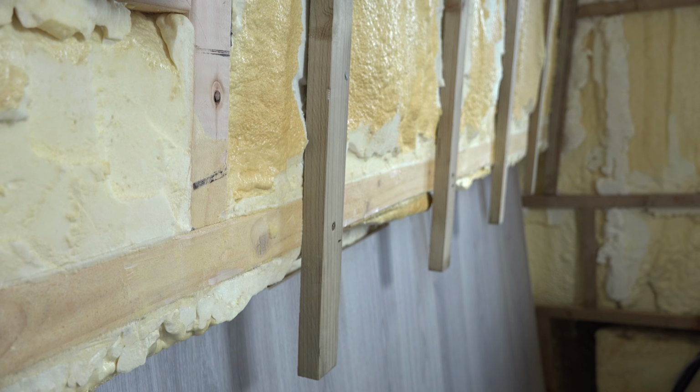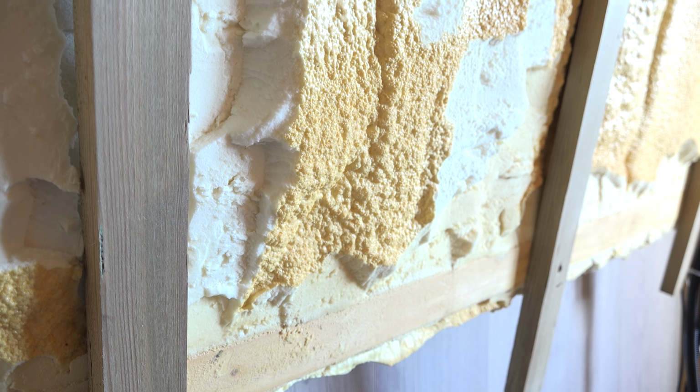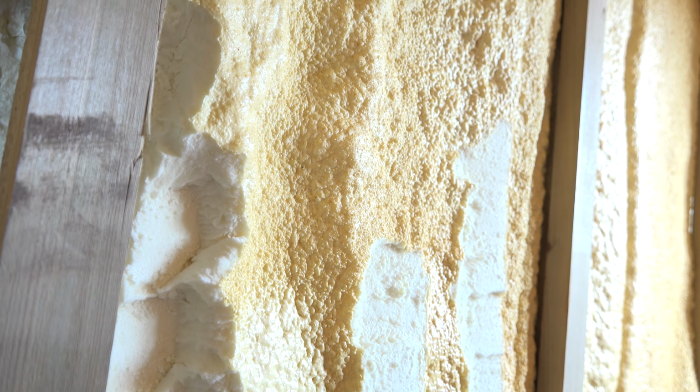The other thing I've actually been doing inside, shock horror, I have actually been doing some things inside. I've been starting to board it out. Now, as you know, I put vertical battens down above the gunnels, down the length of both sides of the boat. They were at 40 centimetre centres, and originally I was going to use some MDF sheets, but that soaked up lots of water, so I got rid of those. And then I thought, well, it'd be really nice if it was actually real oak.